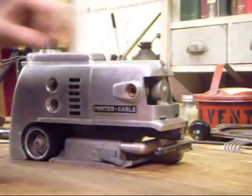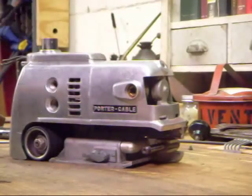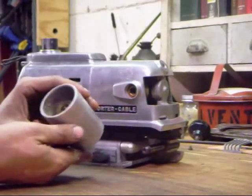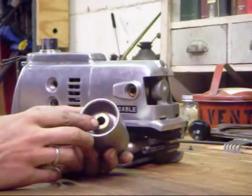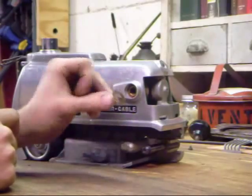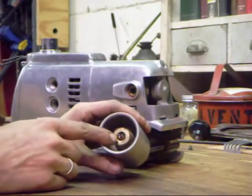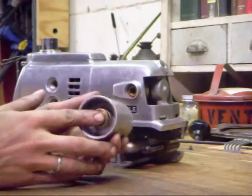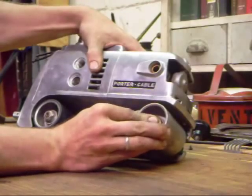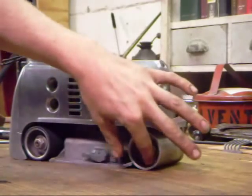The next step is to reinstall our front roller. Move your release lever back. On these rollers, it's important to remember which way is which — the deeper section goes towards the arm, and the shallower part will be out towards the camera. First, put your omnipresent bronze washer on there. Then squirt grease into the hole, put your finger over the other hole, and when you put it in place the grease can't escape and is forced into the space between the two sets of needle bearings.